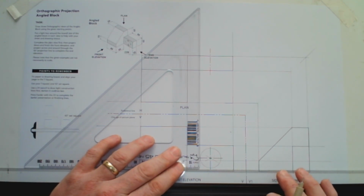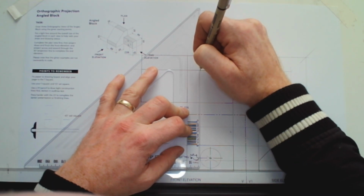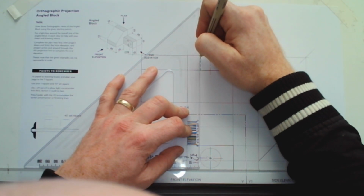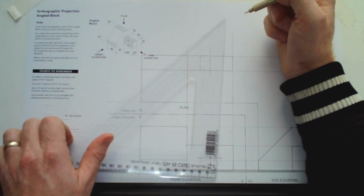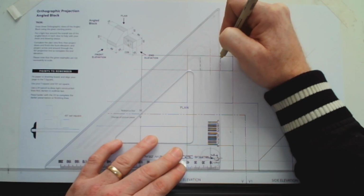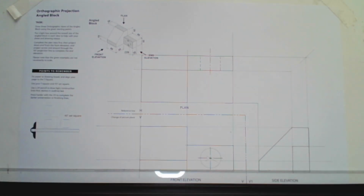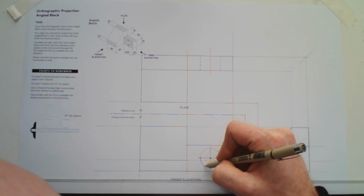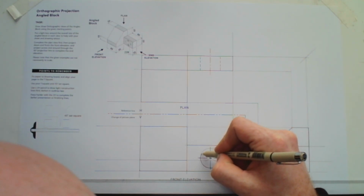And when we do orthographic, we don't just see with our ordinary eyes, we see with our Superman X-ray vision, which means that we're seeing through the solid of this part and finding in between there the edges of this borehole. We call these the hidden lines, and hidden lines are dashed lines. So I've put them in here a little bit roughly, not measured, which I probably should measure: four millimeter dashes with 2 millimeter gaps. But I just estimated them for the sake of time.